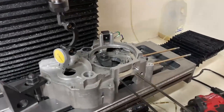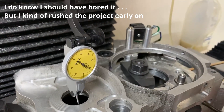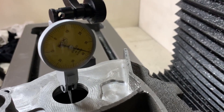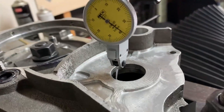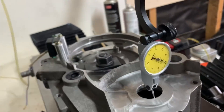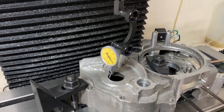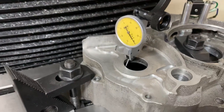I'll speed that up because that was pretty painful, but I think we're there — we are just shy of 40 microns. You've got to remember I interpolated this hole. It actually moves quite a bit there, but then 90 degrees out it'll be just shy of 40 again. Coming around about 90 degrees out we're on 40, so it's out by about 0.1 the whole way around. We're not doing anything to that bore so I wouldn't get too upset — less than 0.1 on the chamfer won't make any difference. In hindsight I should have done that with a boring head so the hole would have actually been round, but whatever.